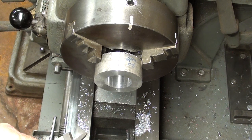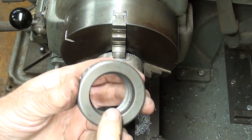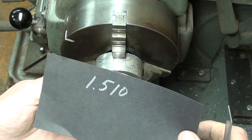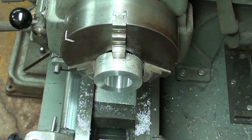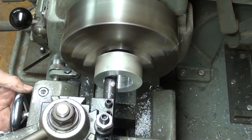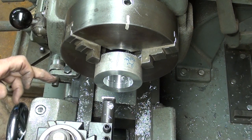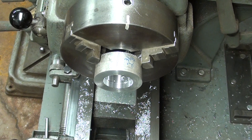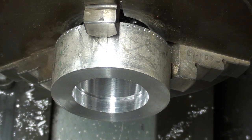All right, I'm at 62 thousandths. Next is the counter bore, and that's about five-sixteenths. The diameter here — I just miked it again — is a little bit over one and a half inches, so I'm going to make it 1.510, and I will set the carriage stop for that depth. I'm feeding by hand, no power feed, up to the carriage stop, and I can feel it when the carriage strikes the stop. That's five-sixteenths, and I've got a couple more cuts to make. The counter bore is complete and I'm ready for threading.